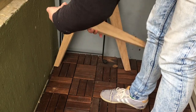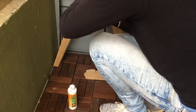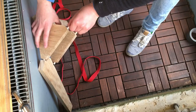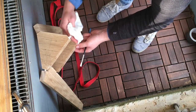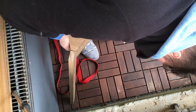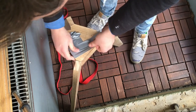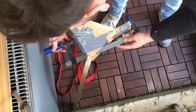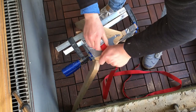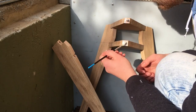Next I started to glue up the legs, making sure to spread the glue evenly. I glued up one leg, let it cure, then glued the second and so on, always removing any leftover glue. The glue needs some pressure, so I attached some waste pieces to create parallel sides so the clamps could grip properly. I let each leg cure overnight to be sure it was fully set.